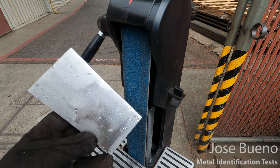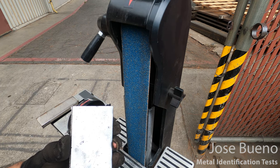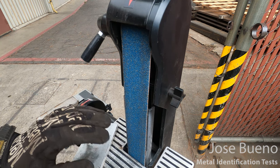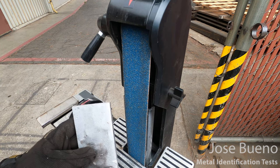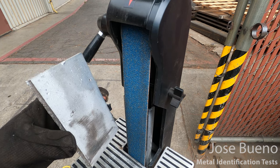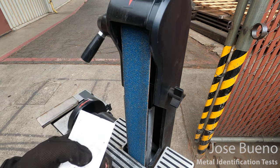This is the sample of aluminum. However, I'm not going to grind this for the spark test simply because this metal does not put off any sparks when using a sanding belt. It's a very soft metal, so all it's going to do is adhere to the belt and gunk it up and render it useless. So we cannot grind aluminum and check for sparks. If you find yourself with a bit of aluminum or suspect something to be aluminum, better be safe than sorry — don't try to grind it.